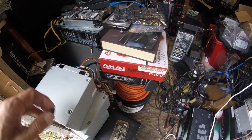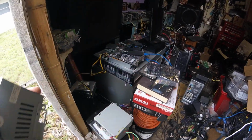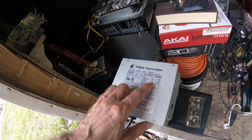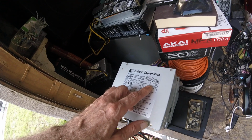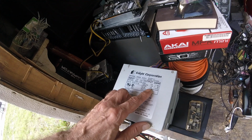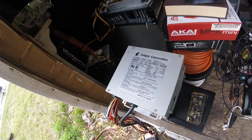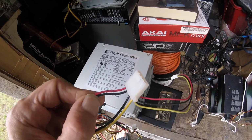Well, on these old ATX power supplies, which are handier than anything, by the way, some of them are still labeled. Yellow's 12, white's -5. I don't know what blue's about because we're not looking at that plug, we're looking at these plugs. The red is +5, and white is -5, and 12 is on yellow, of course. So you would need these 2 wires right here.